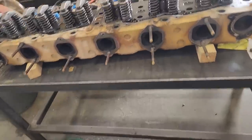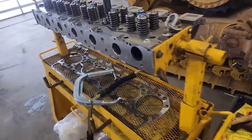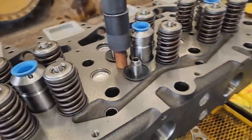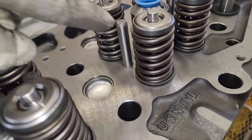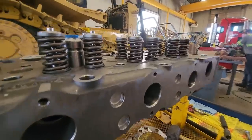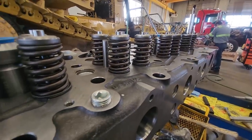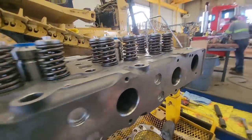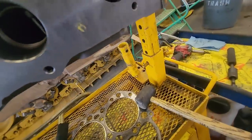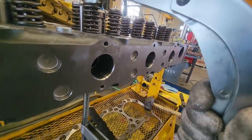You can see our friend the D8 there, and this is the old head. I've put all the valves back in the head — did it while you weren't watching. But we've got a big problem, or I should say 12 little problems, and that is the bridges. The new head has what they call bridge dowels, and bridge dowels are for a different style bridge than we have. It's basically a really long dowel, like an alignment dowel you'd see in a block. The problem is you cannot remove these dowels — at least we couldn't find a way. The proper way from Cat is you have to remove the valves adjacent to the dowel, then you can remove the dowel. So that's why we're removing the valves on a new head — we're trying to remove the bridge dowels.